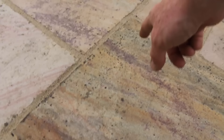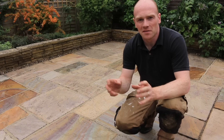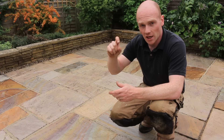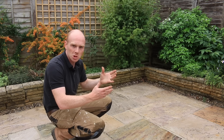We could possibly go one step further and try to get some of this black lichen off, but to be quite honest it was seriously stubborn and it only really appears on some of them. Besides, another year and this will be back to a slightly more natural grey. It really has brought out all the figure in these natural stones. We managed about three quarters of the patio — so if you're trying to work it out, two tubs would do a space around five by five metres. Of course if you've got shorter, shallower, slightly narrower joins you'd get away with more — one bucket would probably do the whole lot if they were nice neat joins. We could also clean up the walling and replace that gravel drainage strip with some fresh brighter gravel to tie in with the now quite bright and colourful patio.